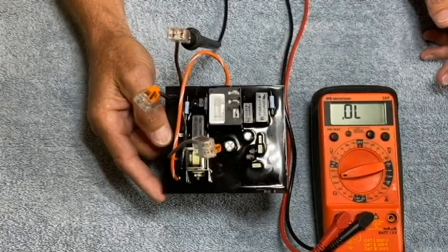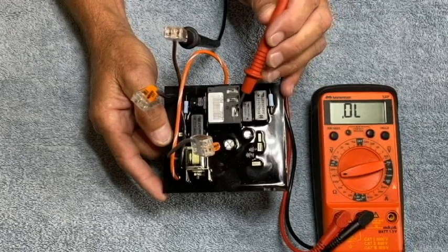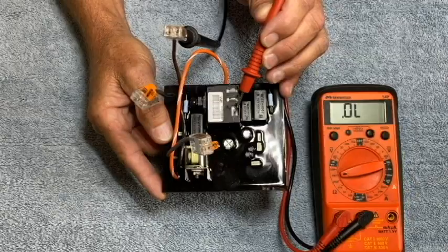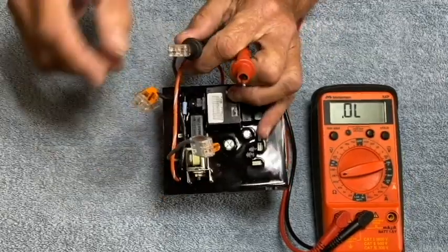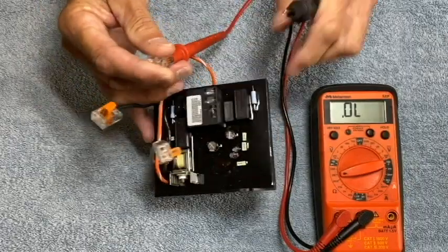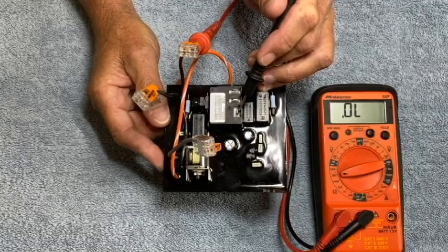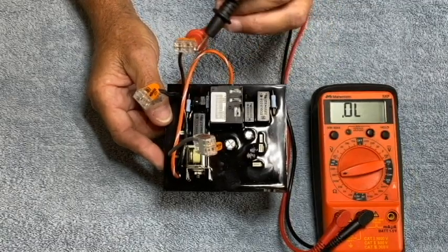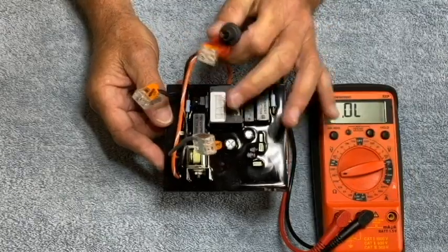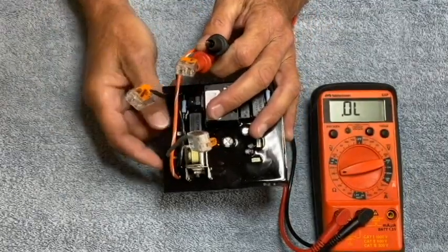Since we're in the 2 million ohm scale, this scale will not be high enough to pick either of those readings up. I'll go ahead and probe here on the common terminal just to demonstrate — as you can see we're reading an open, and the polarity will not matter, so once again an open. As you can tell, the only true way to test from brown to red and get an actual reading is to use an auto-ranging meter, because we will not see anything with a manually set meter.